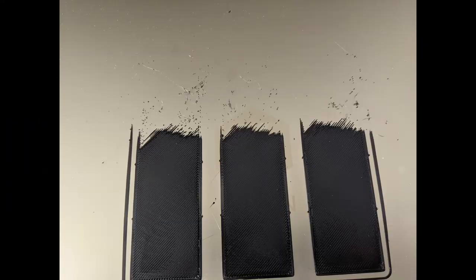Life was good — until the next day, when I was running a few test prints and calibrations, and this happened. It was the weirdest thing I'd ever seen in a 3D printer. It would print the front half of the bed but would not print the back half of the bed. I narrowed it down to the fact that it depended on the angle of the kink in the drag chain. Because after one day of having a serial number, I had my first wire break. People will tell you you've got hundreds, thousands of hours before you get a wire break in silicone wire. Yeah — not for me. One day. Just the one.